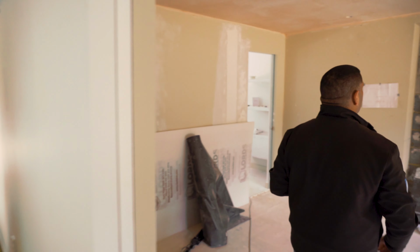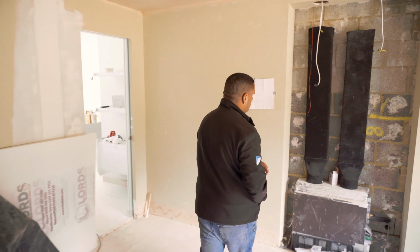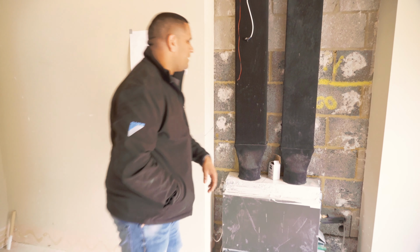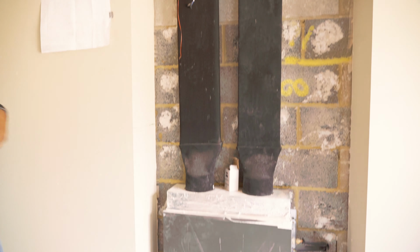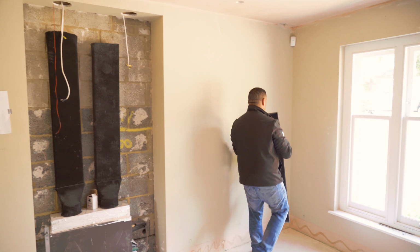So guys, this is the dining room to be. As you can see, another ducted air conditioning unit, low level, we've installed because there's a marble shelf going at this point here on the design from the drawing, ductwork high level, and we have one of these to show you. This is our custom plenum box, which is going to sit there. This will then allow us to install a grill into here on the face of it, so he's going to have a grill at high level.